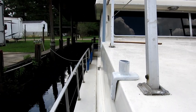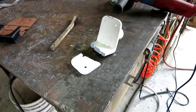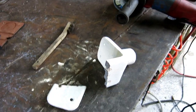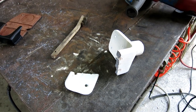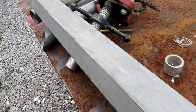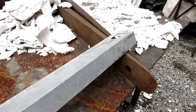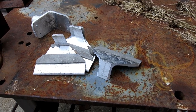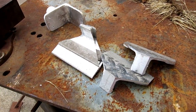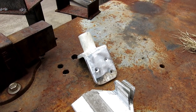I set my bracket over here and it didn't fit very well, so I brought it to my little makeshift anvil, got the hammer, and tried to bend it — and it broke. I tried to bend it with a hammer and a maul and it didn't bend, it broke. I'm going to try to weld it back, and if it doesn't weld I'll have to cast another one, but I'm pretty sure it will weld. I also pulled two pieces of aluminum angle — used on company pickup trucks as protection — out of the trash and cut them up to make the little bracket that connects the post to the handrail. The weld repair on the broken bracket is good, so it will go back on tomorrow morning.